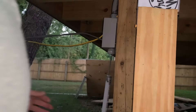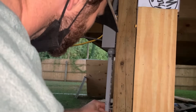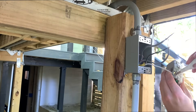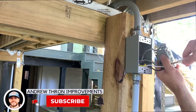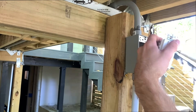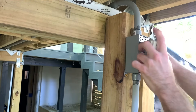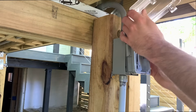After installing the incoming conduit, I'm installing the outgoing conduit and threading the UFB cable down through it. I decided to wire up my GFCI outlet now — it's black to black for the hot, white to white for the neutral, and then attach your ground. Here we are installing the exterior-rated cover.